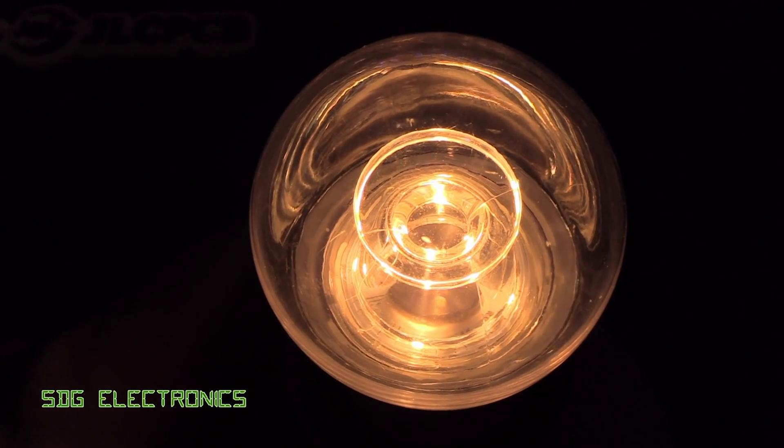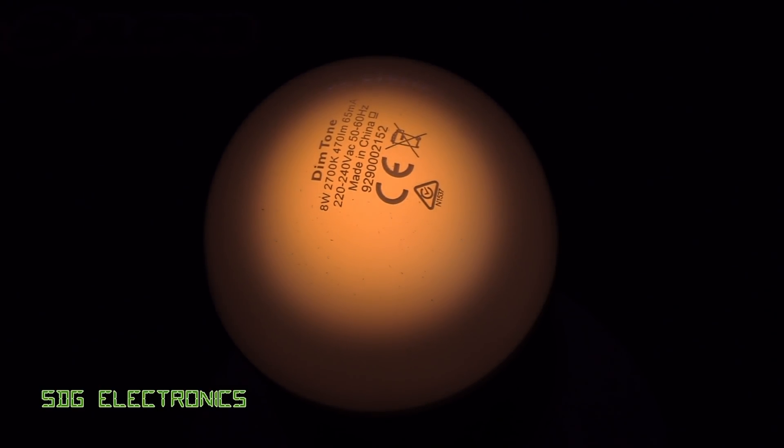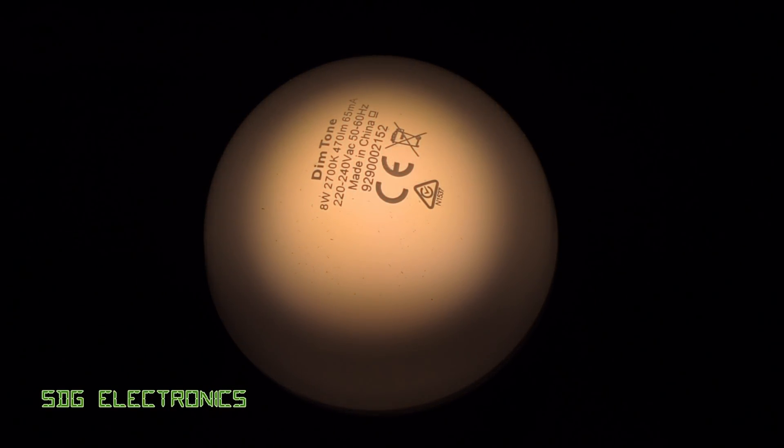So this one works quite nicely. With the other lamp plugged in at pretty much minimum brightness, this is actually very convincing — it really looks like it's just glowing like a traditional incandescent light. It does look like there might be some amber LEDs supplementing the white LEDs, because this is a very nice glow. As we increase the brightness, the dimming isn't quite as linear — there's a weird step. But going up to full brightness, there is a significant colour change, definitely around 2700 to 3000 Kelvin. I think they might be using some coloured LEDs rather than anything to do with the remote phosphor itself.